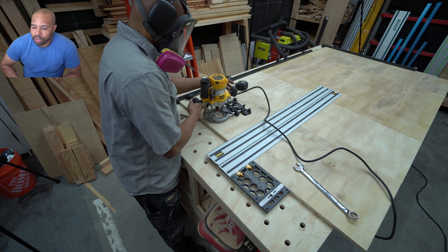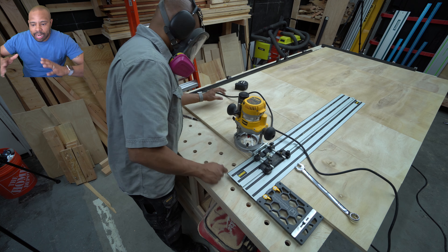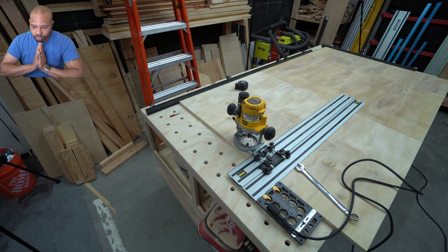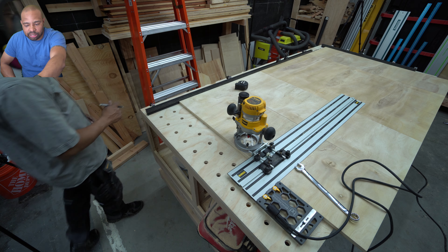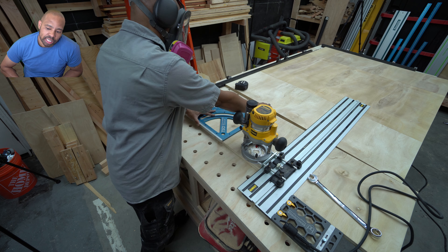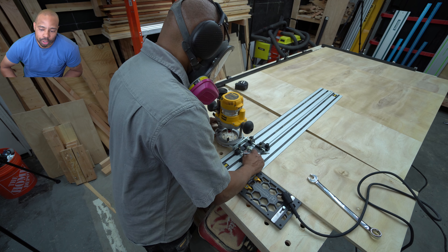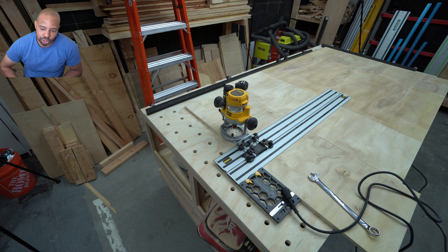I could use the 59-inch but it's still not going to go across all the pieces. So I'm just working out in my mind how I'm actually going to do this dado. You can see the setup — the little adapter for the router has a plunge base and the Bench Dogs rail square attached. Here I'm using the TSO triangle, or square as they call it, which is one of my favorite tools for layout.